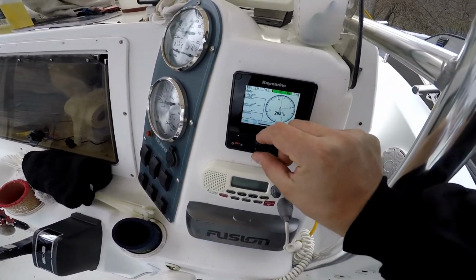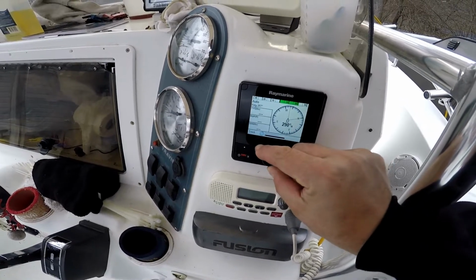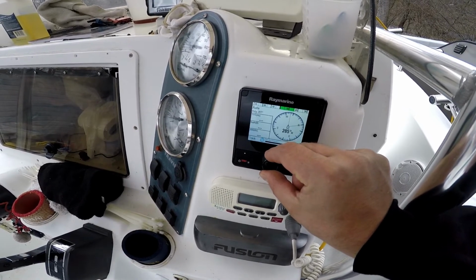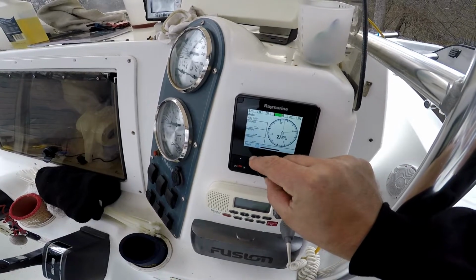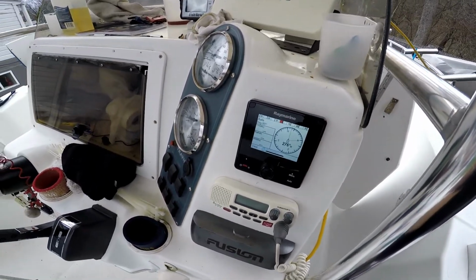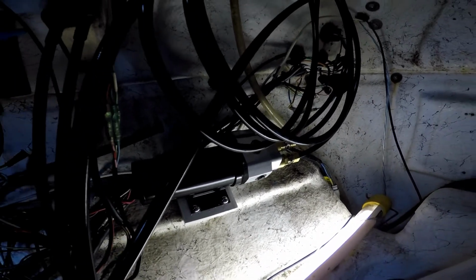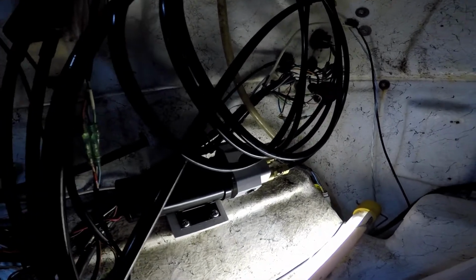And so what I did one side, then I turned it to the other side like 10 times, and also you could hear the pump going. And probably you're gonna see that the engine is not moving at all because it probably still has some air in the lines, but it's gonna clear it out. Just be patient, very patient, it will clear out eventually.